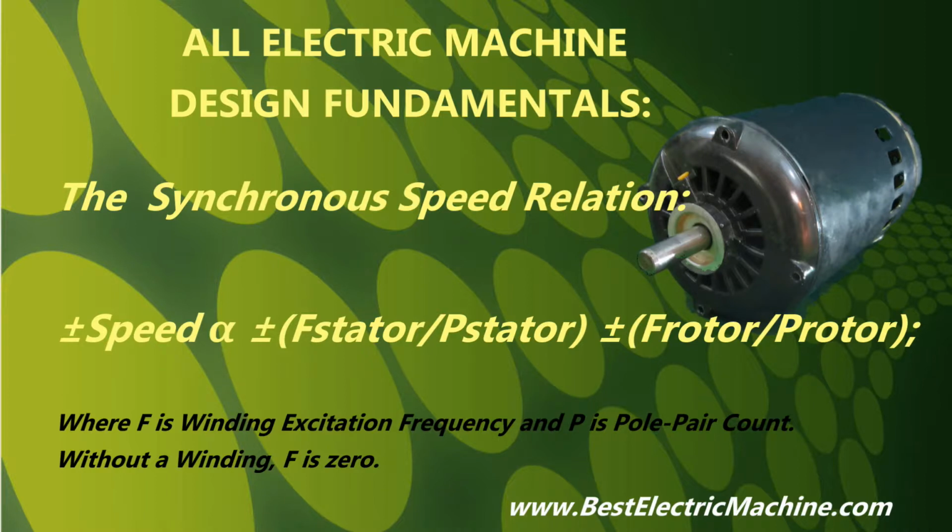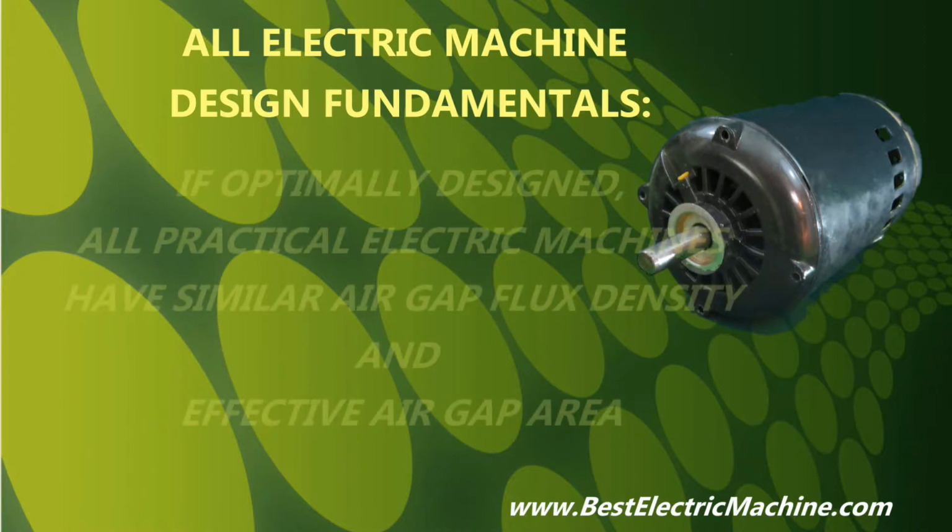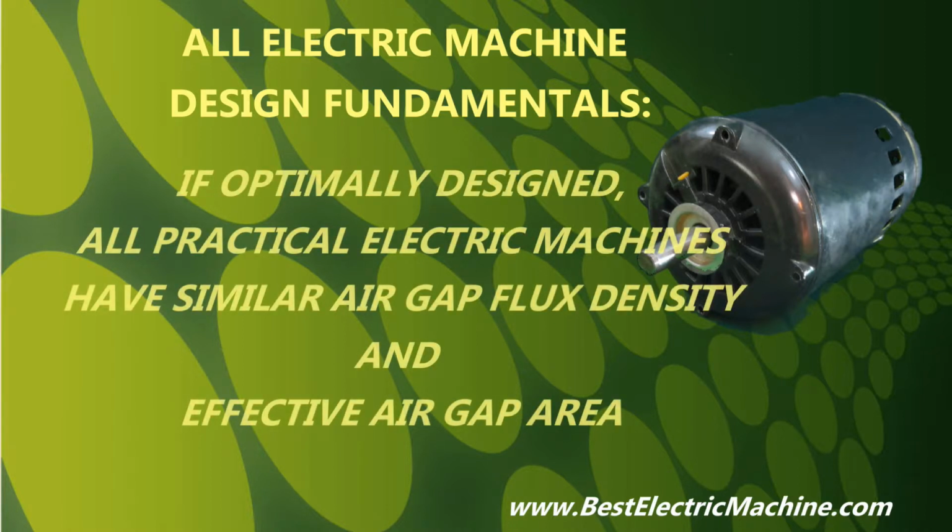Increasing winding current, or MMF, beyond the flux saturation limit of the magnetic core would no longer contribute to torque production or electromechanical power conversion, but instead, dramatically contributes to electrical loss. Furthermore, by effectively squeezing the flow of magnetic flux about the essential slots for containing the windings or permanent magnets, or for forming the rotor saliencies, flux saturation is particularly critical near the air gap by effectively increasing air gap depth and magnetic leakage as more of the high core permeability transitions to the permeability of air